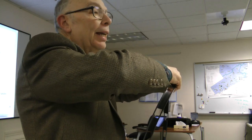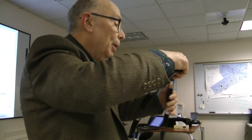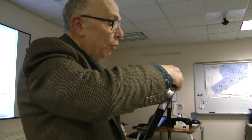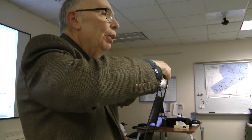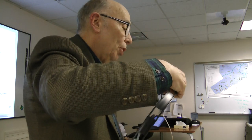This way, you're making an antenna. You don't need any fancy doodads for the middle. You've got a good solid metal. You drill the two holes and then cut to the holes. That way you avoid what's called a strain concentration and reduce your chance of failure. It's probably not likely to happen on an antenna this size, but if you do a larger one.